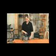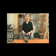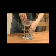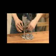have that. And we've done it in such a way that the user can still stand the unit on its head and make bit changes in the familiar position, just as with the fixed base system. Other things that we've enhanced on the plunge base include a new depth rod that's more robust and has a clasp to hold it in place even when it's been unclamped, so as to help with the depth adjustment.